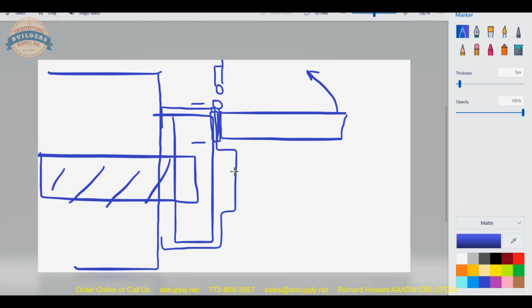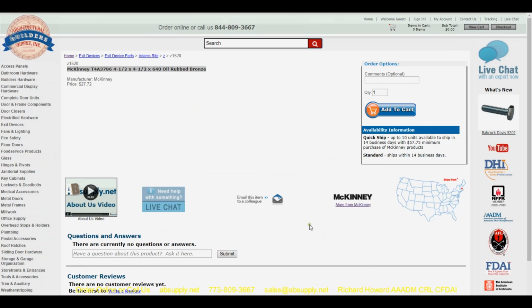Again, if you are wrapping the wall, consider a 4-inch wide hinge. It's a cleaner look, with less projecting hardware. And if you have, let's say, 8-inch block and a 5 3/4 frame, and your client is saying, I need that to go to 180 degrees, you're going to need to think about that vertical axis of pivoting. So that's what we're talking about there.